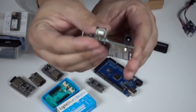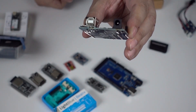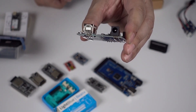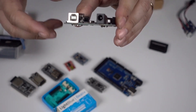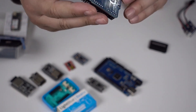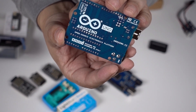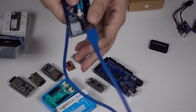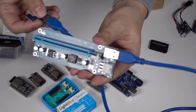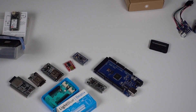We're going to be programming it via USB, so we program using this big chunky USB cable. That's usually one of the first things that people have a problem with when they buy from AliExpress or eBay and get a clone — usually the board's pretty good as long as you don't get it too hot and don't drive too much current through it. This is the official one and you can see it's all nice and neat at the back. The point of failure can often be the USB cable — this USB cable is only intended for power, it's not actually intended for data. So get a good USB cable.